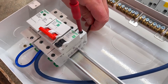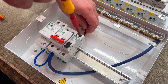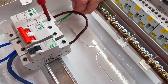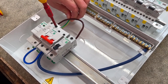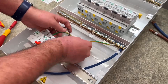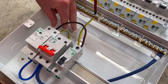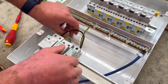We'll now introduce the line cable into the top of the 20-amp MCB, which we will then loop across to the line terminal of the SPD. To finish off, we'll put the protective conductor into the top and then dress it into the earth bar. It is long enough to work whether it's on the left-hand side — and if it were on the right-hand side, that length will help you get from the right-hand side back to the earth bar.